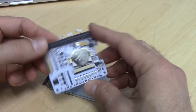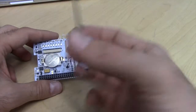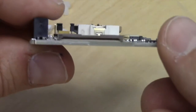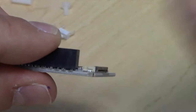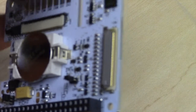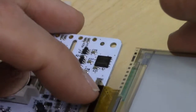There's the real-time clock — nice. Just in case people don't know how to put this on, let's zoom in. And here we go — the actual e-ink display and the connector. In order to put the ribbon connector in, we're going to have to pry open this gently — just up, open it up like so, go straight up. Then once we do that we can see the connectors, and we just slide it in like so. There we go.